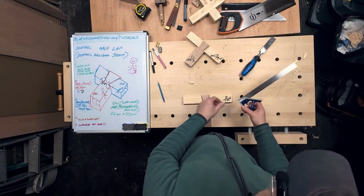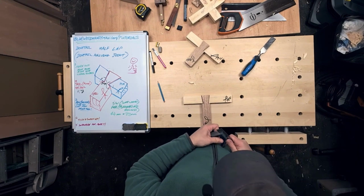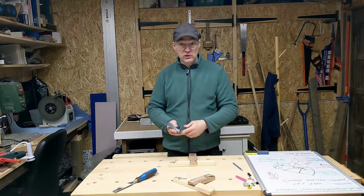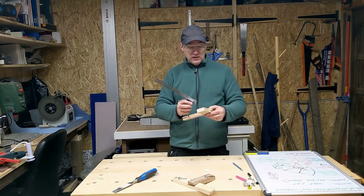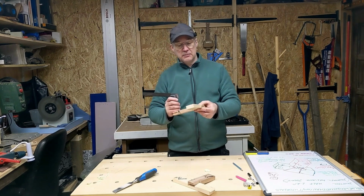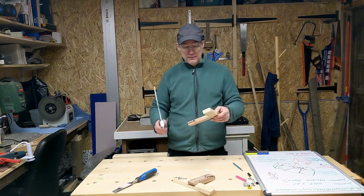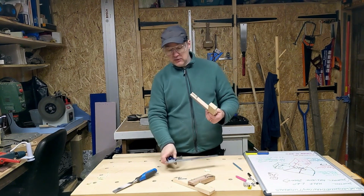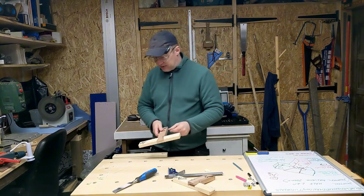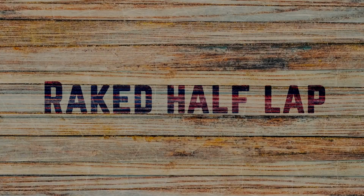And the kind of joint, the gap that you're going for here is minimal gap. But what would be allowed, a tolerance, about 1 mil, 2 mil, and the edge of a combination square is 2 mil. So for my students, if I'm able to take a combination square and if I can fit it in there, it's a 2 mil gap. It's just a little bit much. It's just continually practicing and trying to improve upon that. If that doesn't fit in there, well then you've got a pretty all right joint. Certainly for your first joint, I'll be pretty pleased with that if it's definitely less than 2 mil. That's what you're aiming for.